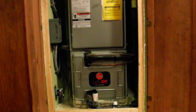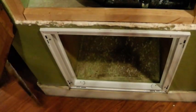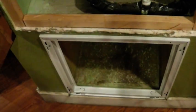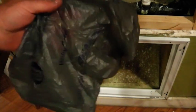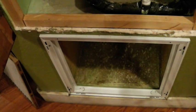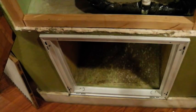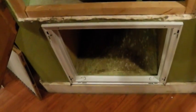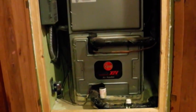She said come on out, so we did. The first thing I checked was the filter — she had a nice brand new clean pretty filter just like this one. But when I got up and looked at the coil, I pulled out a Walmart bag, McDonald's wrappers, and the evaporator coil was covered in dog hair. I got the flashlight out and showed her: it's not a crappy install and it's not a crappy air conditioner — it's a lack of maintenance. She asked how much to clean it, I said $99. She told us her son would do it and we could leave. Maintenance is very important. The cleaner you keep your air conditioner, the better it will run, the longer it will last, and the less electricity it will use.